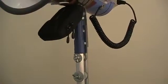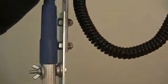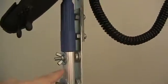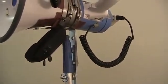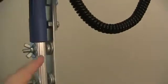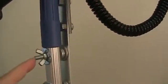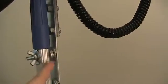If you're doing these holes at 1/4 inch, oh, that's another reason why I was wanting to do 5/16: these metal brackets here, those holes are 5/16, and I was hoping that the bolt I used through the telescoping pole would be the same diameter, just to keep everything real nice and snug. But since I used a 1/4 inch bolt, that means there's potential for some wiggle room in those holes, and so I'm pointing to this hole up here because it's the same size as the hole in the bracket down here. And so since there's that wiggle room, I'm like, oh, am I going to have to put some extra torque on this thing so that it doesn't wiggle around?